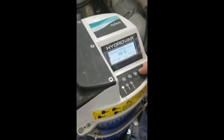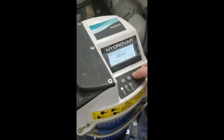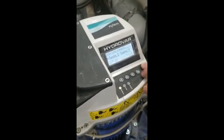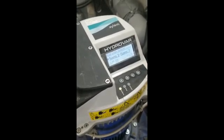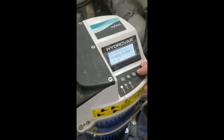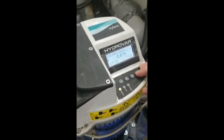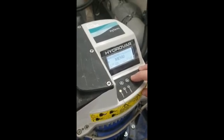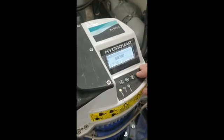Hysteresis has come from 80 to 90, and we carry on through. Sensors — we're running in bar. Configure sensor has been set at sensor one, sensor two, so it will measure the inlet and the outlet, minus it, and it will then give you a set point. That's your transducer settings, that's your sensor range, and none of those other settings we change.